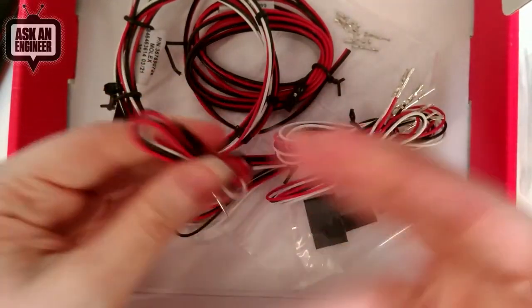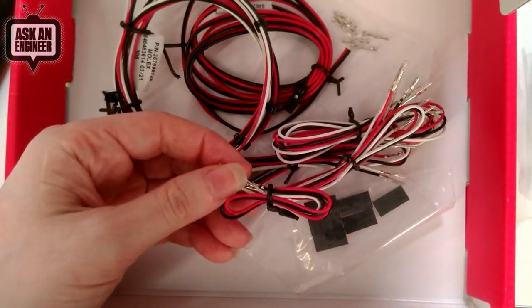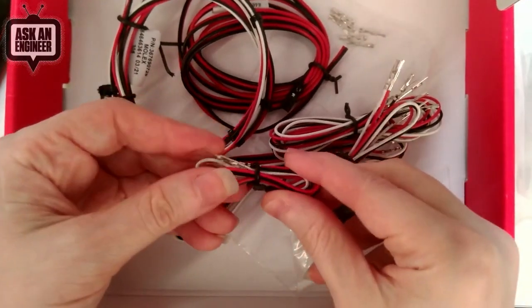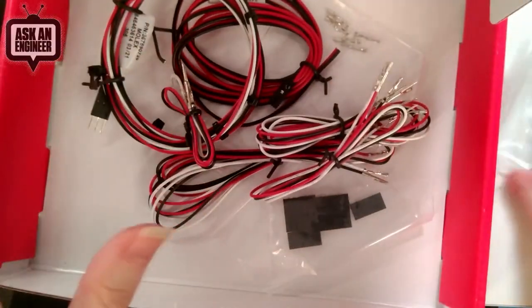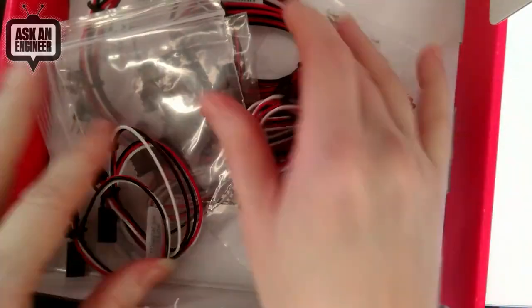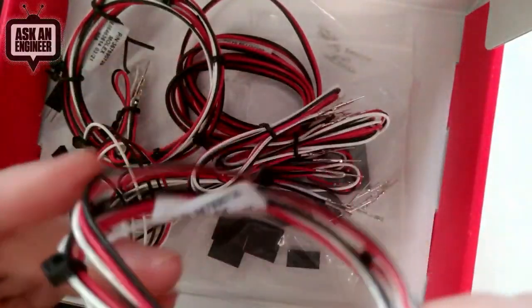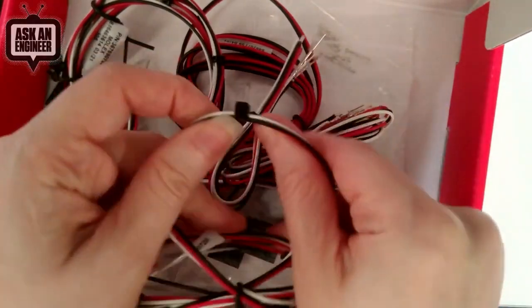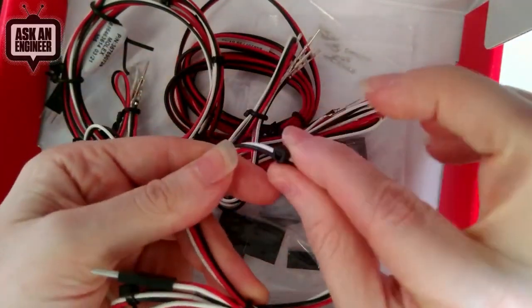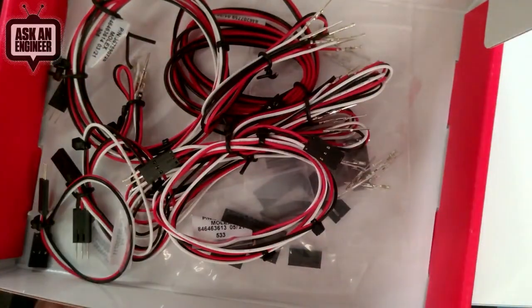Don't forget, you can cut and solder these wires. It's easier to cut and solder and then heat shrink cables than trying to recrimp wire. So that's what I recommend. But this is a good little sensor servo extender kit. Nice durable wires, nice thick gauges, and they all have this nice zip tie keeping the cables together. But you can always cut it if you want to spread the wires out. All right,